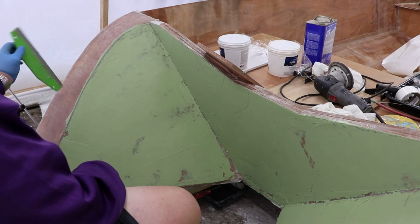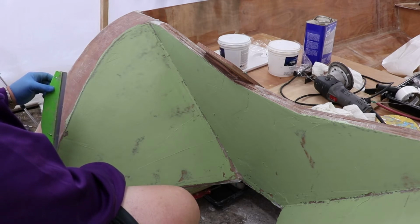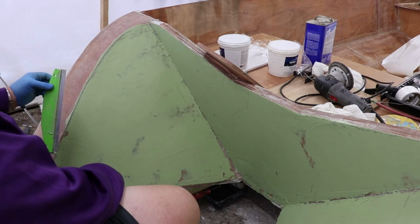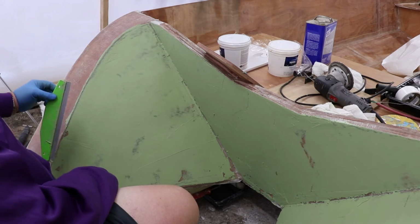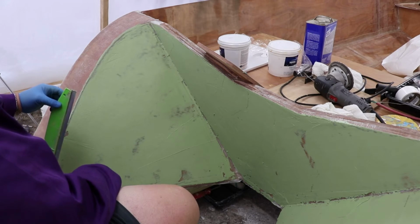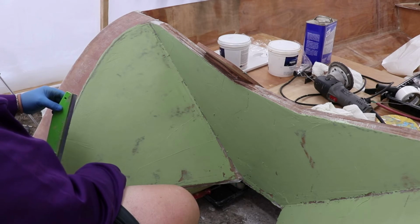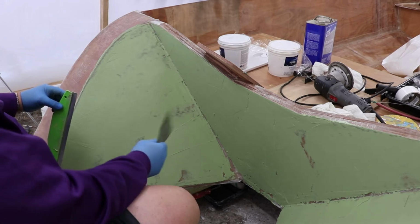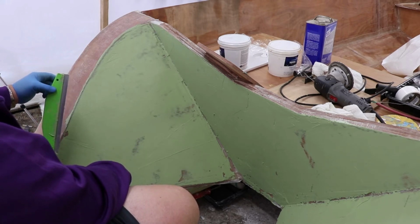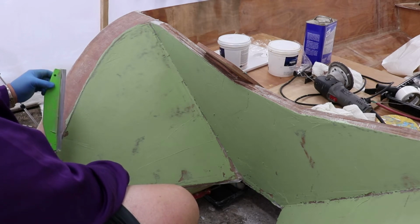All right, sponsons are left. Let this harden for a couple hours. Hopefully that heater is doing a little something something. And hopefully we can start sanding this bad boy tomorrow, and then sure we'll do another coat. And keep working down with our grit. Get the corners filled in. Get this bad boy nice and smooth so we can flip this boat over.